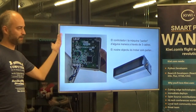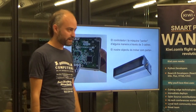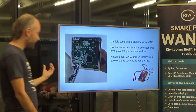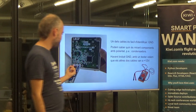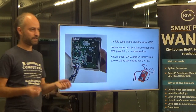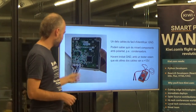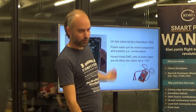This is the board — behind the remote controller. It has three wires that go between the two devices, and that's how they talk. But we don't know much more. So the first thing I did was figure out what those cables do. One is ground — ground usually has the thicker tracks and capacitors with one leg going to ground. With a multimeter you can see the voltage. So we know this device uses 12 volts.